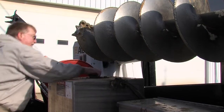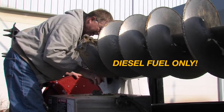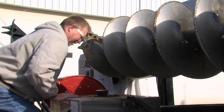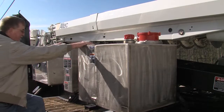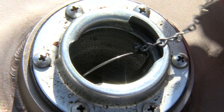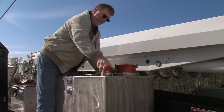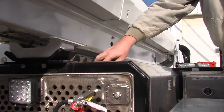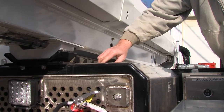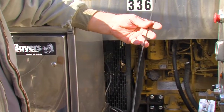Check the fluid levels. The Polesetter runs on diesel fuel only. The 40-gallon fuel tank should be at least half full to ensure that the machine will continue running on steep slopes. The hydraulic oil should be clean, and its level should be above the screen found underneath the cap. Also check the antifreeze level. Pull out the engine oil dipstick and check the level.